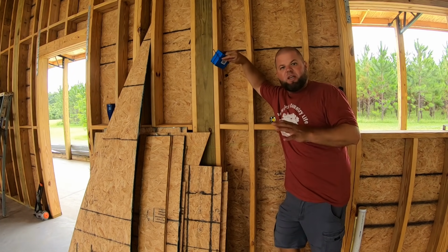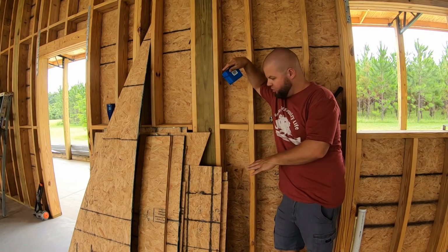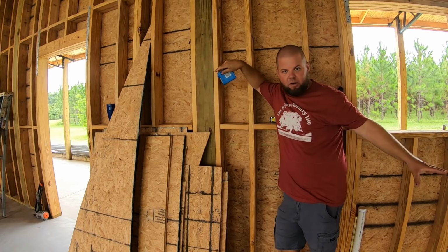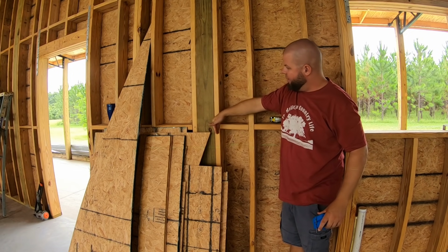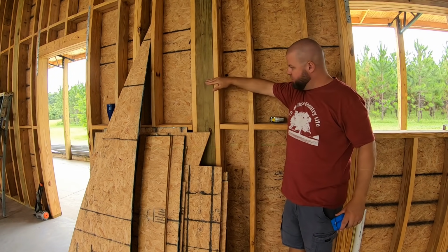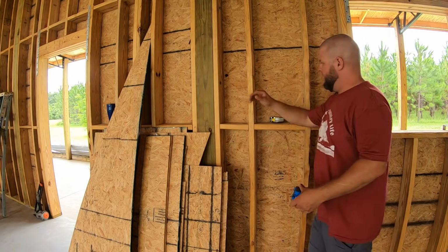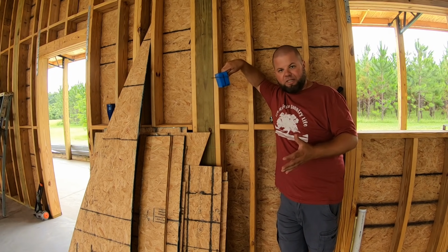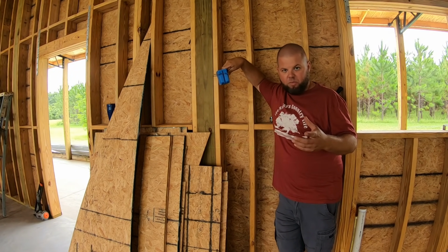All right, so I am seeing all kinds of crazy different heights for outlets over your cabinets. Now keep in mind, we're going to have a bar top over here, then it goes into your standard height kitchen cabinets on the way around. So I figure I'm going to run all my outlets on this side of this 6x6 right here, and then we're going to have switches just over there because this is technically the countertop height. Now I know we're probably going to go with standard countertop heights, which are 36 inches, it's most common. Then you typically do a 3 or 4 inch backsplash.